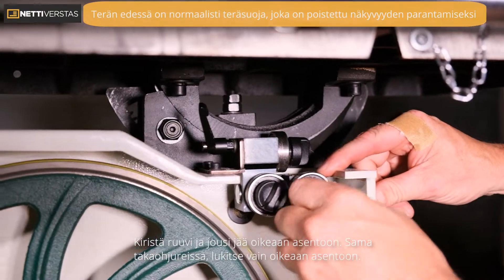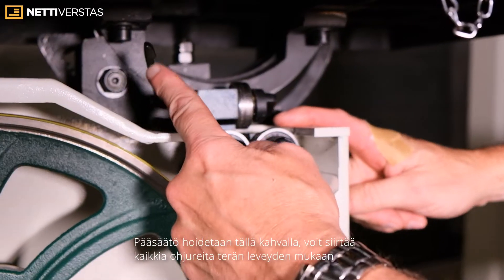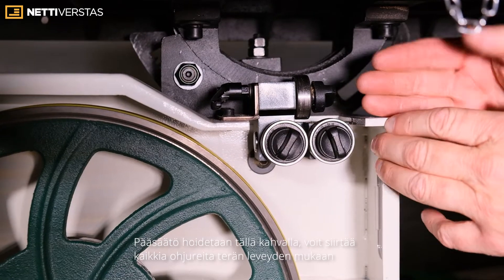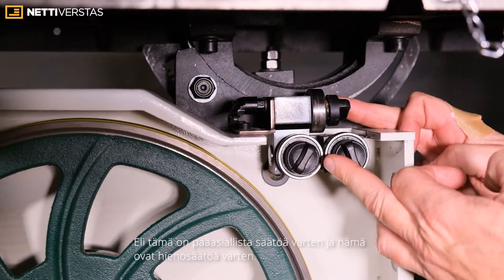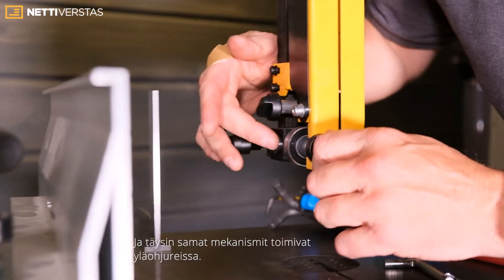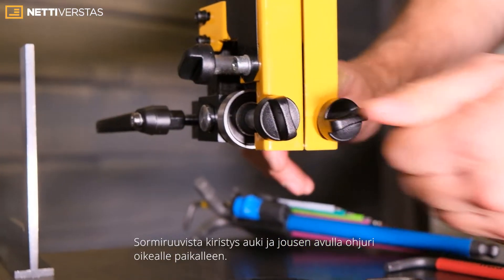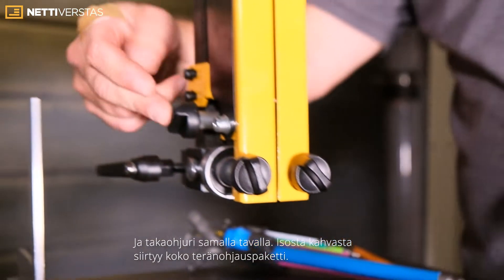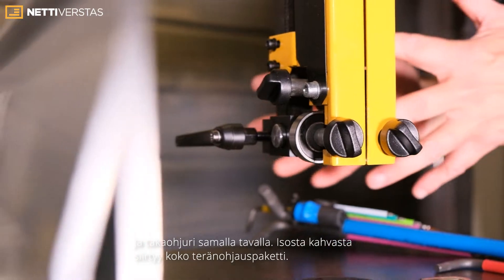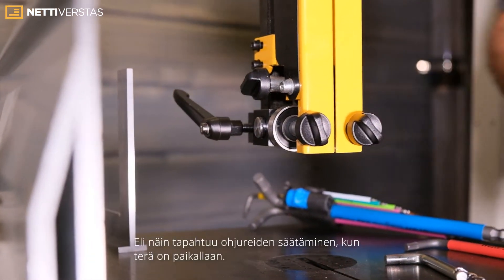With the spring in place, lock off. Same at the rear and lock off in position. The main adjustment is the ratchet handle, which takes the guide all the way to the back or all the way forward depending on blade width — that's your coarse adjustment and this is your fine adjustment. Then replicate that above using the spring again: loosen off and locate, then the rear one, and the ratchet handle for front and back movement.